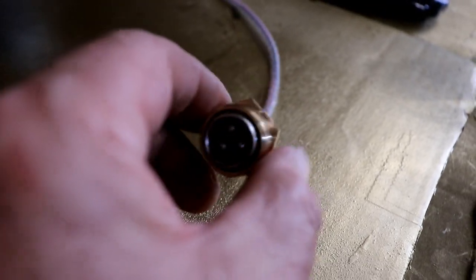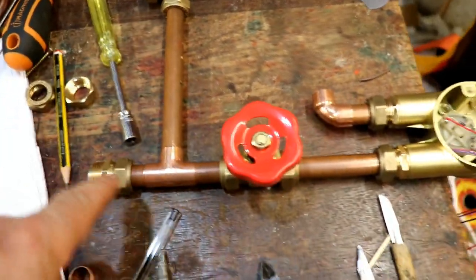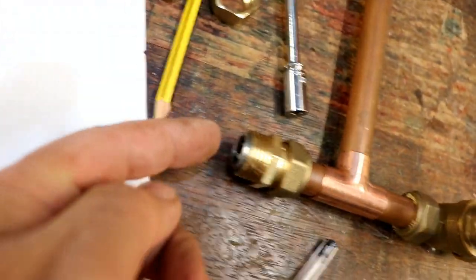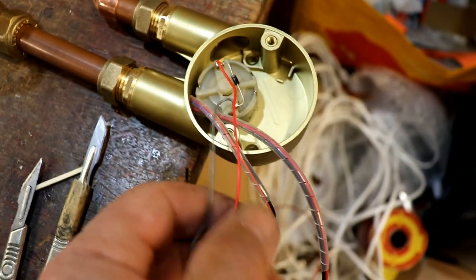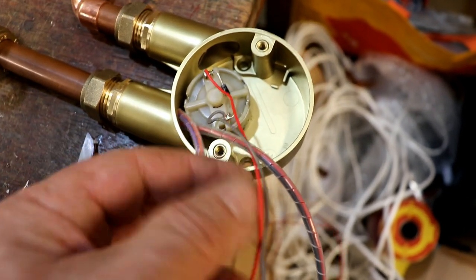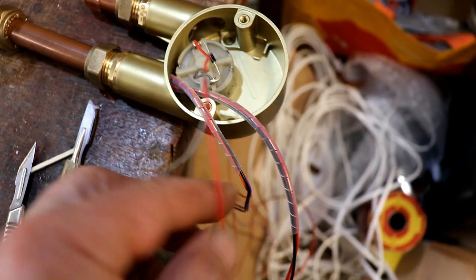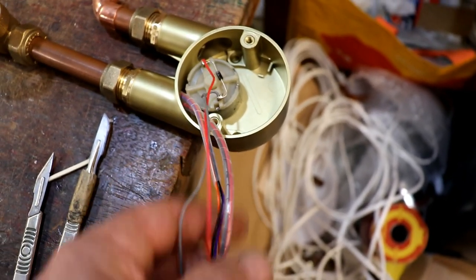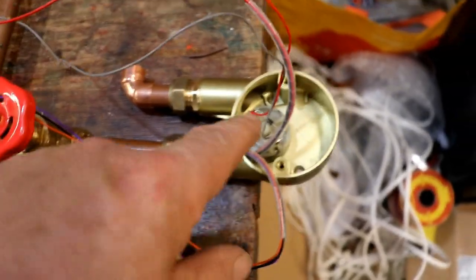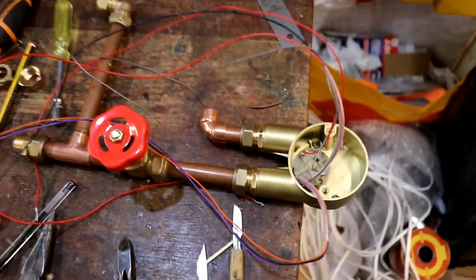Got these pipes together — that round pin plug socket thing is brilliant. I was resting them here to keep everything flat. We've got the power wires, red and black; the wires from the encoder, black, orange, purple; and the wires from the bell motor, red and gray. All the blacks go to naught volts, all the reds go to plus five volts, and the others go where I've made a note. I need to thread all the wires through this bend before fixing everything into place.